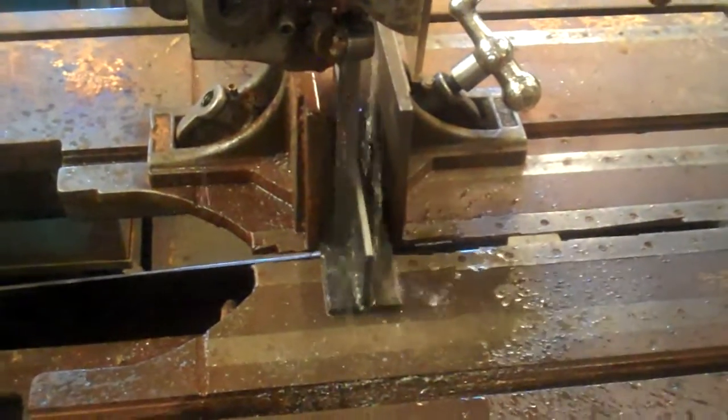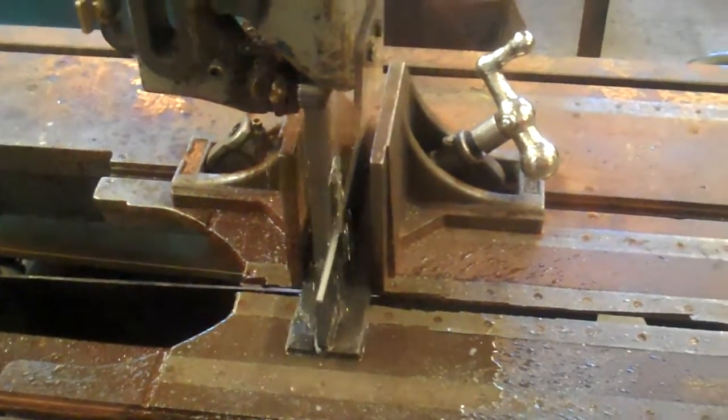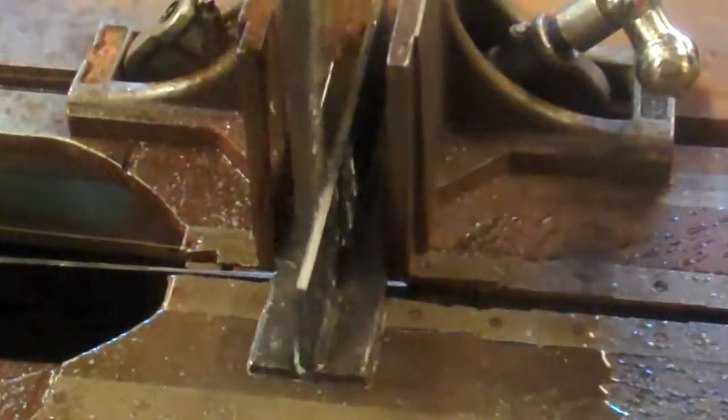As you can see during machine operation, the fluid dripping down here is going to lubricate the saw blade so it doesn't get too hot. It's very important that you keep the machine lubricated. As you can see when it gets to the larger parts where it's cutting more metal, it automatically slows itself down because you can feel the tension coming. If you just let it do its thing, it will eventually get back to running at a higher rate.